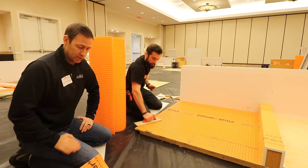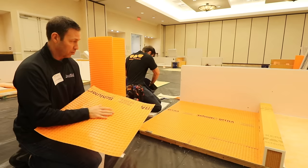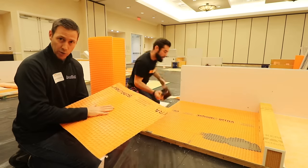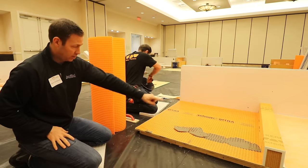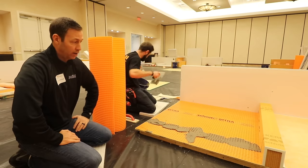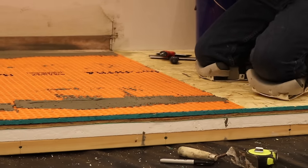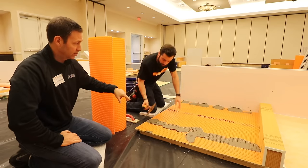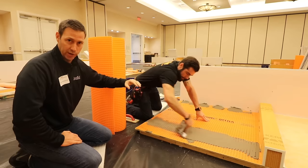Something really interesting I like about this membrane: the polyethylene body is totally waterproof — this is a waterproofing membrane. We're not in the shower portion of this demo; the shower is on the other side. However, where seams come together, we're not waterproof because we've cut the material. Schmitty has a T-shaped seam here that he's going to waterproof using KERDI — a waterproofing membrane from their shower system. He'll use a couple-inch band of KERDI to get two inches of coverage on either side of that seam.